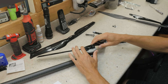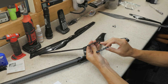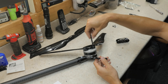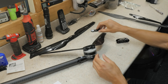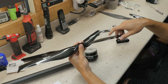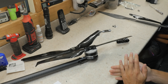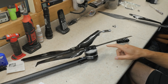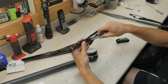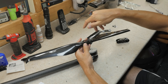Now I'll talk about a couple of the negatives about these adapters — but one more positive first. What they've done, which is interesting, is they've actually press-fit the screws into the top plate, which is nice because that's what actually prevents the blade from flying off if it ever swings around. But the problem is, when you put this blade on, the only way to tighten the propeller blade — if it ever gets loose or is too tight — is to adjust the nut on the bottom. And when the propeller blade is on, there's no way to access it. So if you live in an environment with constantly fluctuating temperatures, the propeller blades tend to loosen and tighten by themselves and you have to constantly adjust them. I feel like they could easily fix this by press-fitting the screw through the bottom of the adapter instead of the top, so you could put the nut on top and have access to adjustment.